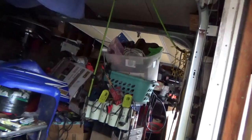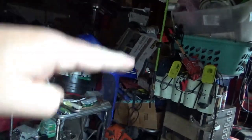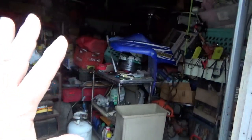It has four garage doors — 8 by 8, 7 by 8, whatever they are. The doors are insulated; I went with the better ones and they seal pretty well. The ceiling I went with that mylar membrane — you can see how it reflects. The problem with it is when the wind blows, particularly during the summer with one door open, it has a tendency to balloon and get torn up. I put some plywood up to help mitigate that and insulate a little better.